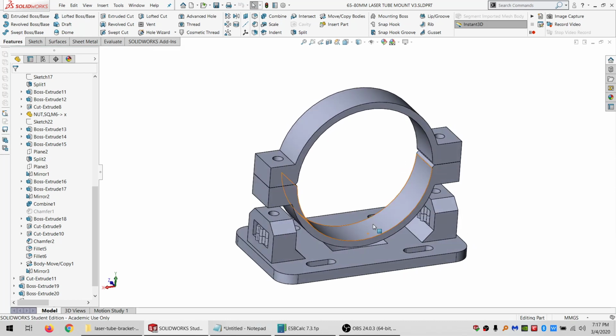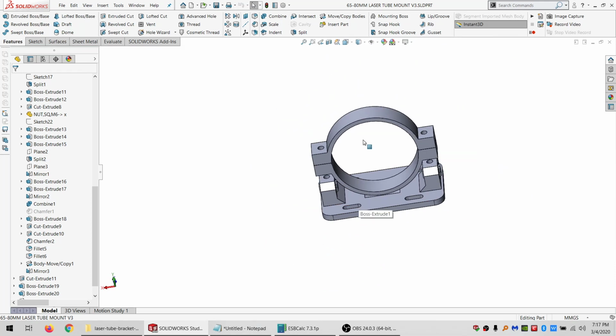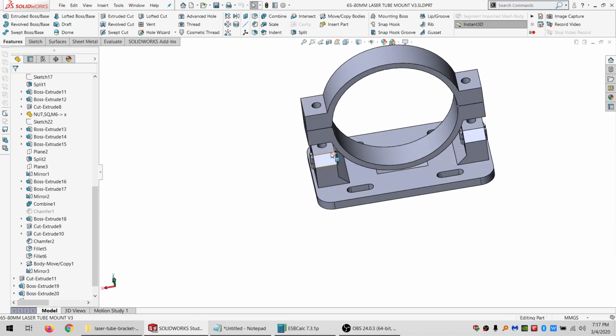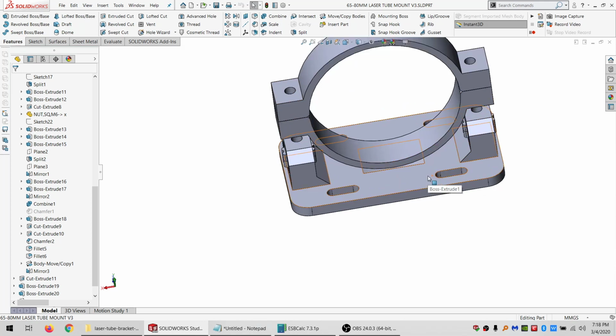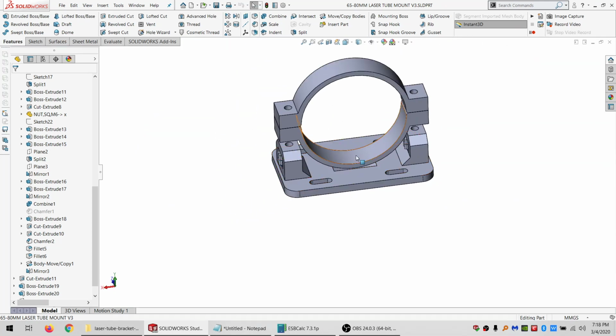But now I'm replacing the tube, and I don't want to go through the whole calibration nightmare that this presented me. So I'm going to redesign this. Basically how this works is the tube goes through the center, and this is up against a flat wall, which makes adjusting this dial impossible, which makes adjusting the height impossible unless you slide it out. Then you lose home, or you lose the center, so you're constantly fighting back and forth.